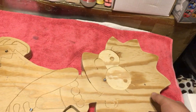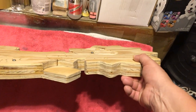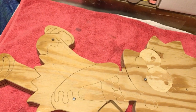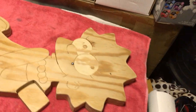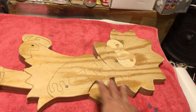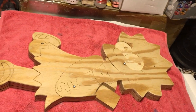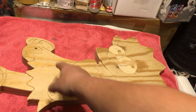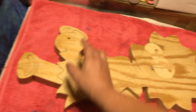And since how I do the three layers of plywood, and I still haven't, I cut the neck tenon yesterday, but I didn't actually glue it in. I was going to wait on that. Today what I wanted to do, inside, was just put the neck on there and see if I got the right height and do a string test with the bridge and lock the neck in exactly where it's going to go as far as the lines and the positioning.